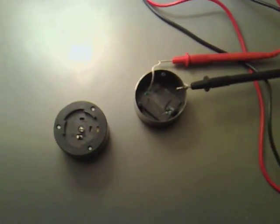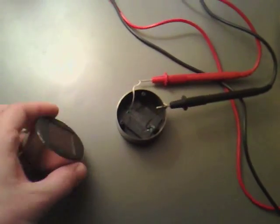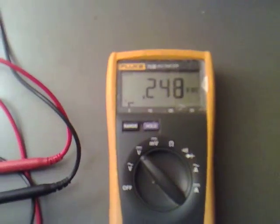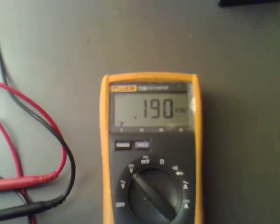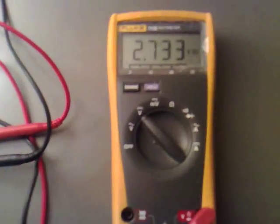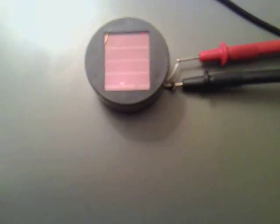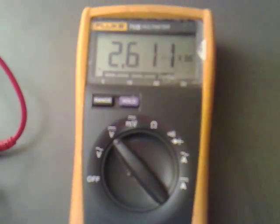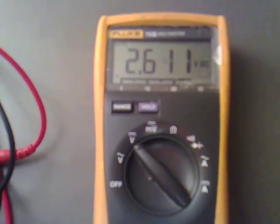Like I say, I got it from Poundland, so I bought three or four of these. This is a complete unit, and this is a unit I've stripped down just to the solar cell — we're getting about 2.2 volts off it. If I turn that over, we're getting 2.733 volts. If I move this lamp closer, you can get a decent 3 volts off that, which is good. Basically under ambient light we're getting about 2.5 volts, so we could probably charge about 2 AA batteries off that.